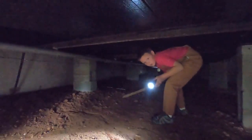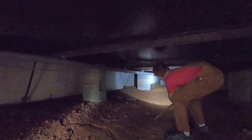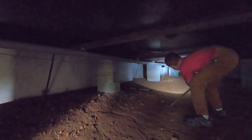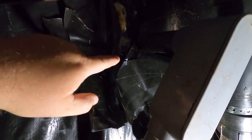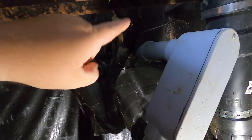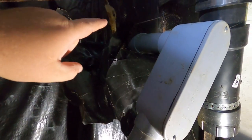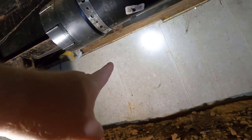All right, Elijah, we're going all the way to where the gray pipe goes up into the floor because that's where the power goes into the panel. And that's where we're going to look for a place. We have reached the point where the power comes from our outdoor meter base, turns up and into the floor. I'm going to open this area up and reach my hand up there to see if I can find the wire that runs from our furnace circuit over to where the electric furnace used to be, because that's the wire we're going to reuse and run out through the wall that way.